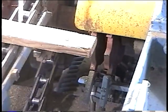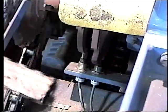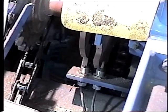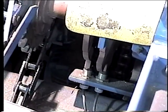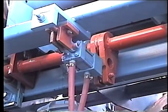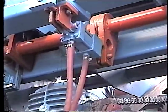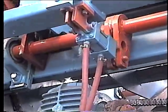The control system for the tong feeder is very simple. At the end of the feeder head shaft are two tabbed wheels. These wheels are like the distributor in your automobile. They are monitored by two proximity switches to control the release of stickers and the sticker chain advance and pans-down timing. Through the control system, an air cylinder is actuated to release or exclude stickers as required. Here is the cylinder which performs this function.